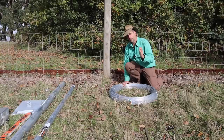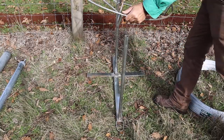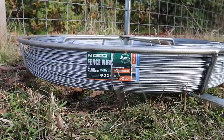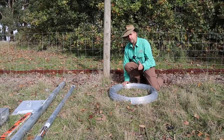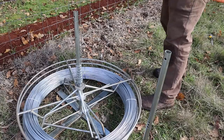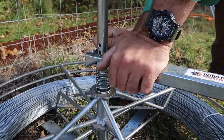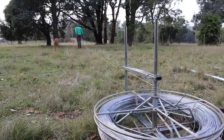Now I need to start running out my ground wire to get my posts nice and straight down the fence line. I'm going to put my wire spinner in place with the long part of the frame pointing in the direction of travel, then put the base ring on, then put my wire on top of the base ring. It's very important that the wire goes on with the label facing the correct way up so you can read the writing — if you put the label on upside down, the roll will be upside down and it will tangle every time. Once correctly positioned, put the top ring on, the tension spring, and the tension bar on top. I normally start at a middle tension setting, secured with the two pins. As you run out wire and get less on the reel, you can release the tension on the pins to keep the tension even.